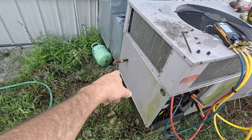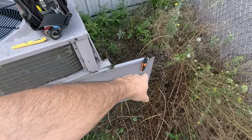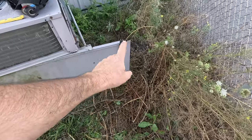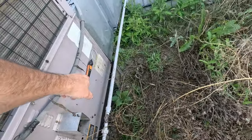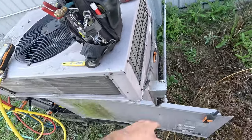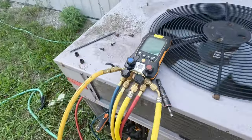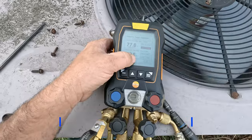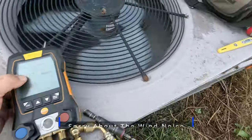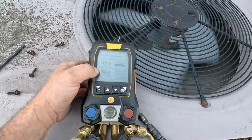So we've got our probe set up — got the return there, got our outdoor temperature here since we're doing superheat. On this particular one, we're actually using the 605i gauges. Depending on what you're doing — if you're doing temperature only, you'll have to use the 915, which is capable of doing just regular temperature. So we came into our settings and picked smart probe or manual input. It's 77 degrees according to that, which is within a degree or two of what it actually was. Return came in at 62 wet bulb, which is kind of surprising.